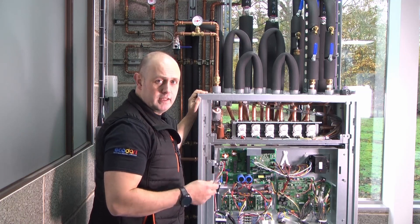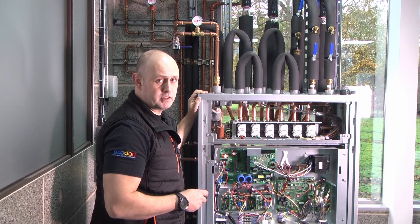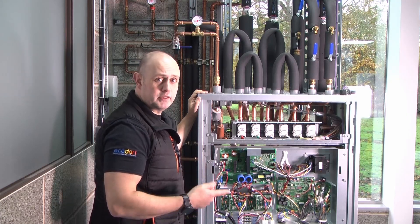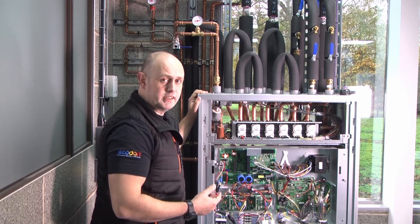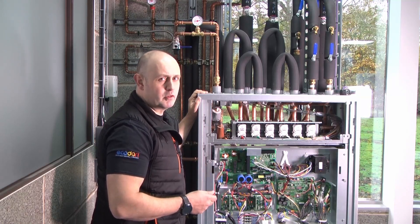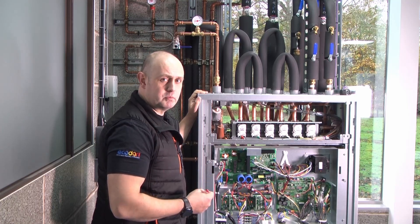And that is your air removal completed — all ready to get on with the rest of the commissioning. That's just testing and running in heating. Then what I do is run each unit in cooling — keep everything running in heating, then switch the first unit into cooling and make sure the indoor unit starts doing cooling. We're making sure the indoor units are connected up the way we thought they were and that everything is working correctly, getting decent air-off temperatures.